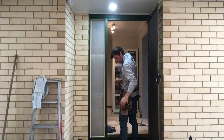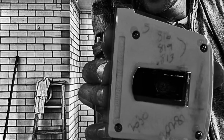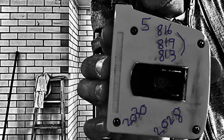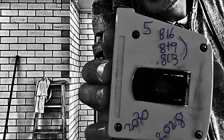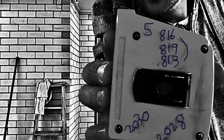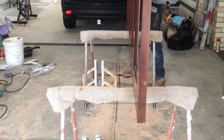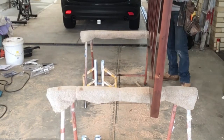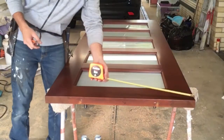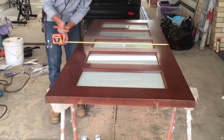Also look at the sides to see if there's a bow or where the bow is. On my tape you can see I've got five at the top — that's indicating how much out of square it is — and also a curve on the right-hand side showing which way the bow is going. That 819 in the middle is wider, so it's bowing about three mil in that direction. I'm looking down the length of the door to see which way it bows. It's a timber door and they all have a little bit of a bow, so I'm just flipping it to make sure it fits the door jamb in a complementary direction.